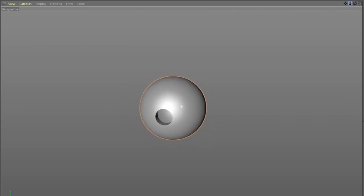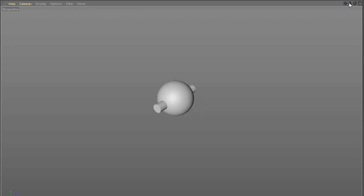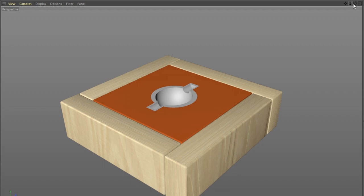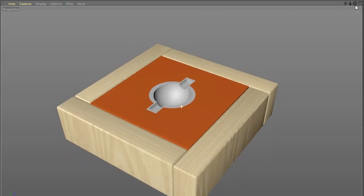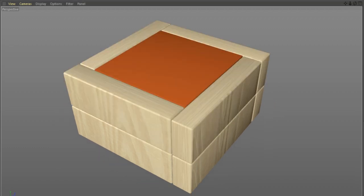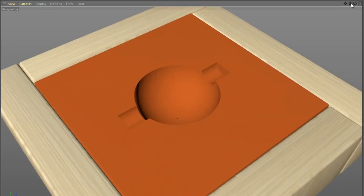Here is the part I want to make, a hollow aluminium sphere. So firstly, I made a two-part pattern of the sphere to 3D print, split down the middle. Notice a sticky out bit of tube, this is what the core sits in. The first half of the pattern is rammed up in the casting sand. Then the second half of the pattern is added and the top of the flask is rammed up. The flask is opened and the pattern removed, leaving a void in the sand.